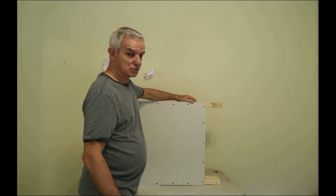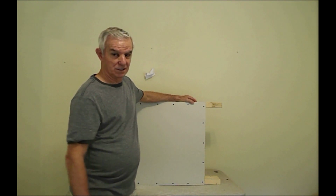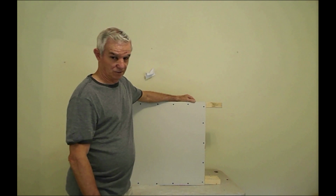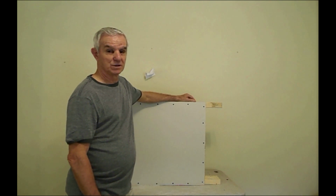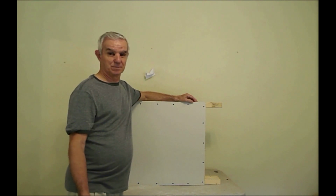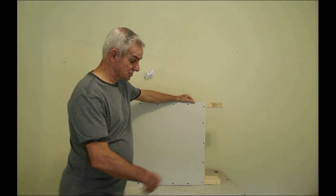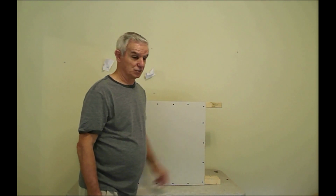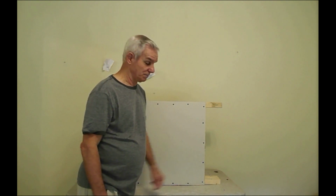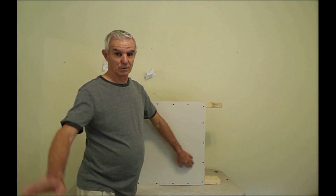Now, most restoration companies that's been doing this a while, they will gladly cut it out. You won't have to beg them to cut it out, believe me, because they make money doing it. So they're going to do it. What you have to watch is when you got somebody that's inexperienced, or just getting into the business maybe, and they come out and first thing they do is suck out the water. They'll put a little bit of sealer on it if they know what they're doing as far as that goes. Half the time they don't even know that, but they may just put sealer on it, paint it, and try and get away with it.